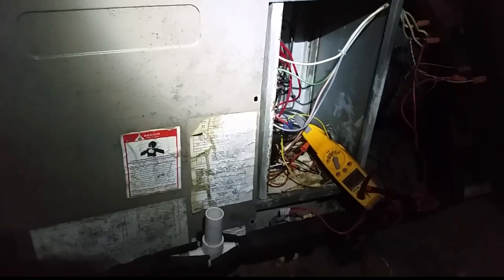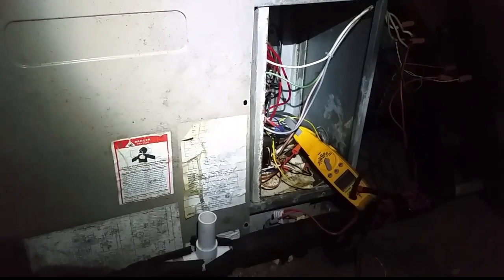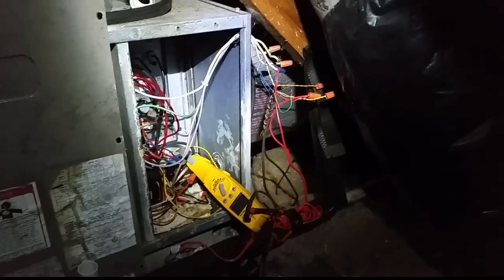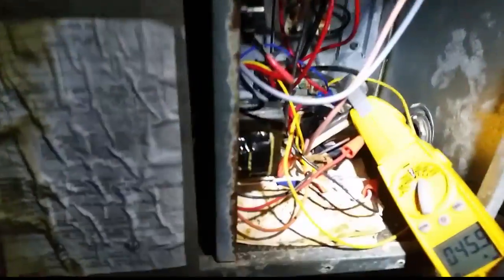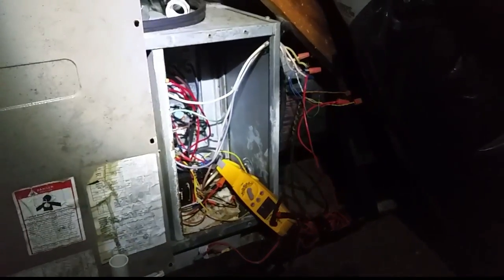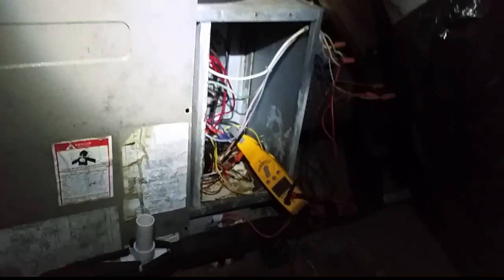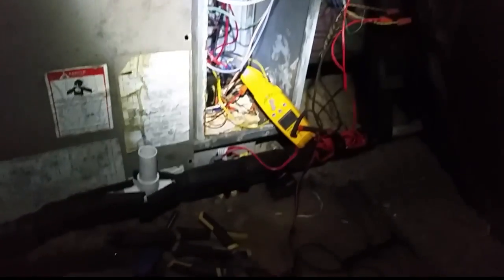As you can see, it started much quicker than before - 40 seconds. That definitely beats 10 minutes, because remember that 8-minute reading had two extra minutes before I actually started the timer. Much better. I also repositioned the transformer - it was sitting at the bottom of the cabinet before. I removed that old dangling brown emergency heat wire since it tied in with the auxiliary heat wire on the inside anyway, so there was no real need for two wires. It was dangling outside the cabinet bare and would have eventually shorted out and blown the transformer. We're running at 45 amps - happy day! See you guys on the next one.